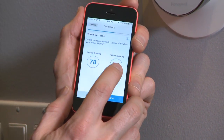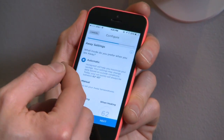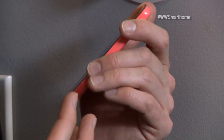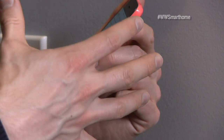The Lyric does everything a programmable thermostat does, plus it has a few other intelligent features. You can set your away temperatures to automatic or manual right here. Automatic means that it will use your smartphone to determine whether or not you're at home — so it's going to know when you're outside. The feature that controls that is geo-fencing, so it knows the exact geo-coordinates of your home based on your smartphone. When you leave, the app will automatically tell the thermostat to set to the away setting, saving energy.